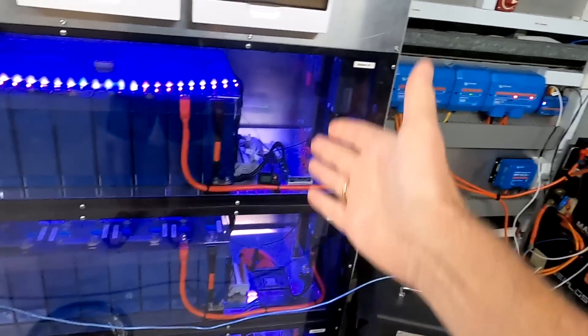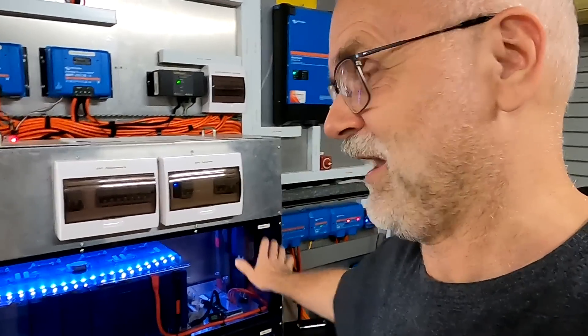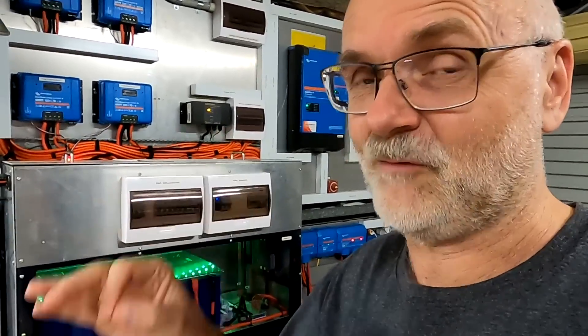Another scenario: you want to extend your battery bank with another battery. Usually you have to bring them up to the same voltage before connecting them. With these BMSs you don't have to - just connect them in parallel and the BMSs regulate this themselves. I've had the battery shelf running for over a year with no issues from cross currents. Even if you turn one battery bank off accidentally and forget it for a couple of days, one of these current limiting BMSs would have no trouble slowly balancing your battery banks against each other again.